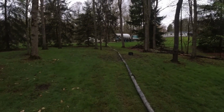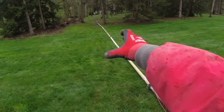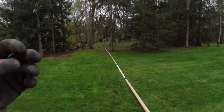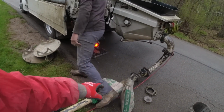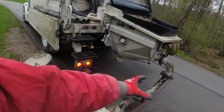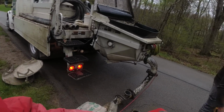Oh yeah. So, okay, here, we'll get them mixed up. Let's go. Pumping the concrete through this much steel line is not so much of a problem. The rubber line pulls the moisture out and pulls the cream off of the rock, and it jams up. So we get a couple bags of Portland, mix it up to a slurry, dump it in the pipe, sort of prime all this, and get it coated with just some slurry.